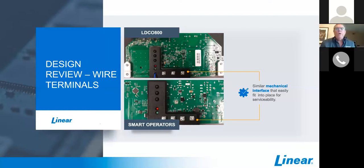That's important. Then you would plug that operator into high voltage, and then you would set the limits, and we'll go over limit adjustment in a bit. The 3 buttons on both these logic boards are for DC openers only. Doesn't matter if it's smart or non-smart. They're your up-down limits, your learn limits for transmitters, and your door pressure.